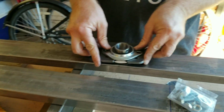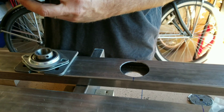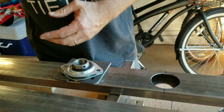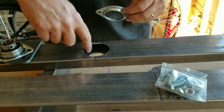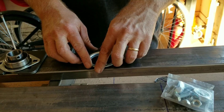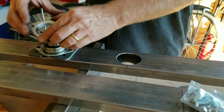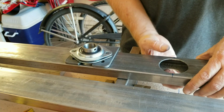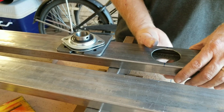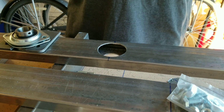So this is the outer bearing — it's going to go here, get welded and bolted in place later. But for now the holes are cut. The outside was a two and an eighth I think. That just barely fits. If you were not using the outer plate you'd sand it with a sanding disc and get it. If you went with a two and a quarter it's a little bit bigger — I wanted as much material here as I could get to give it strength. But if you're using this plate like it's designed, then it's easy. The interior one is inch and a half on the inside, which gives room for the axle to have some space. You can go bigger if you want, but again I wanted as much material here as possible — that's the weak part of your frame where the axle mounts.